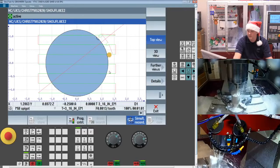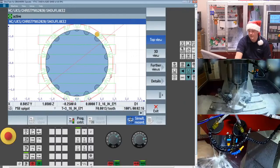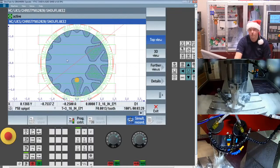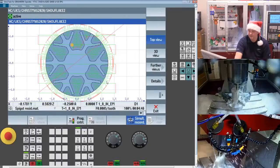So now we're going to come in, we're going to clear out the part. Now this clearing section, if you download that NX file, that G-code file that I created, I did this a little differently. So on the machine and the program you're going to download is more like planar milling, right? So I'm taking in a few different planes. Through NX, I used an adaptive milling strategy.